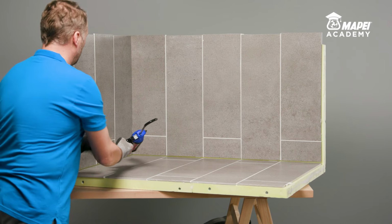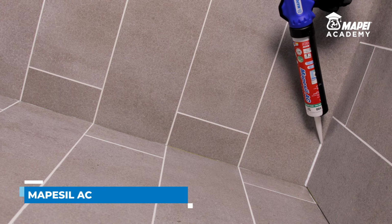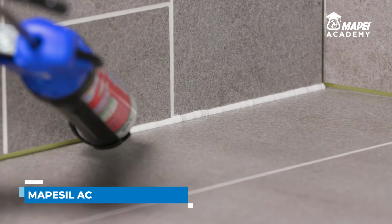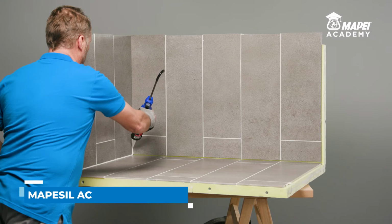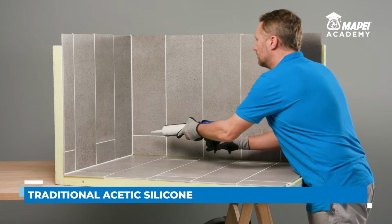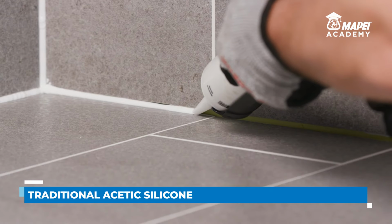Condensation and mold could form very quickly in damp environments with poor ventilation, such as bathrooms and kitchens, and on cold walls in general. Mold is a natural consequence of organic material being exposed to particular conditions in terms of humidity, temperature, and ventilation. It's easy for the surface of any rubbery sealant applied in a damp environment to be attacked by fungal spores, which then go on to provoke the formation of mold. The presence of specific biocide additives in the sealant slows down adhesion of the fungal spores and, as a result, the formation of mold. Apart from carrying out sufficient maintenance, a sealant resistant to mold depends especially on the quality and amount of biocide used.